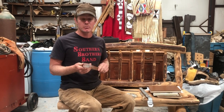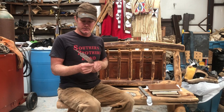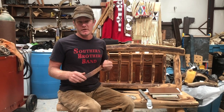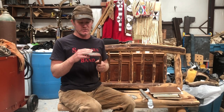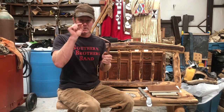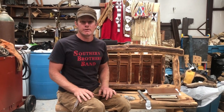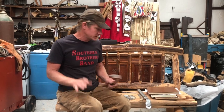I don't personally care for file blades anymore because it took me forever to realize that a thick blade — if you have to use a thick blade, use one — but if you can use a thinner blade, all you're doing with the thick blade is fighting yourself. Every time you have to sharpen it, which is often, you're fighting through all that metal, all that bulk. All you're wanting is just that razor-thin edge. It doesn't need to be any thicker than to keep it from hopping while you're scraping.